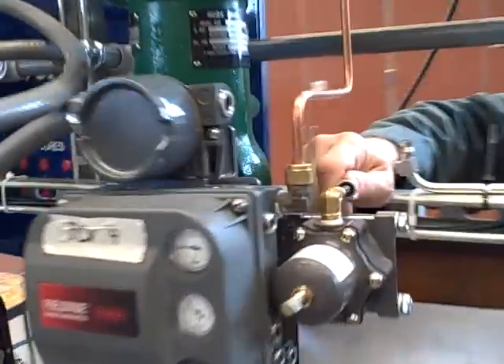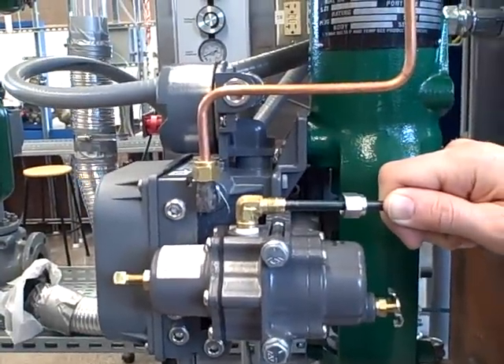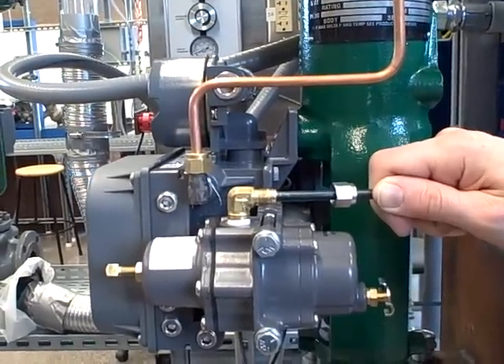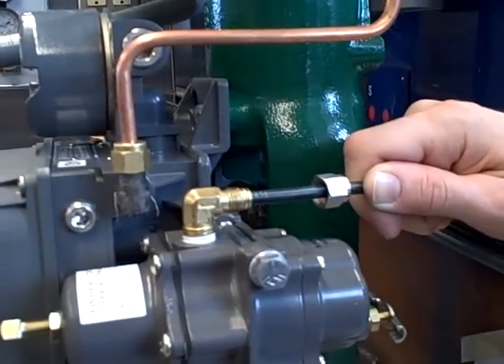You can actually see the fitting. Come around to this side, so you're looking in that direction. Very cool. So what we have here is a Swagelok instrument compression fitting that is being used to join a plastic tube with this tube connector supplying compressed air to a valve actuator.